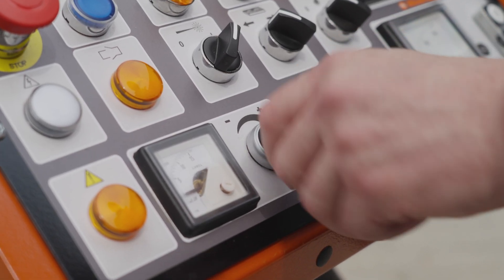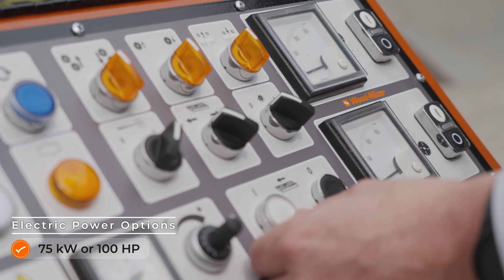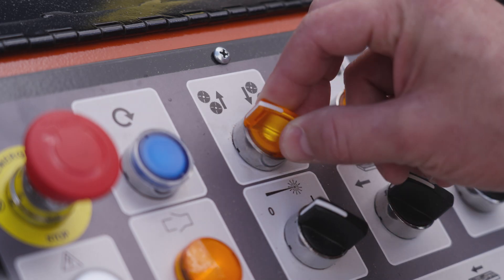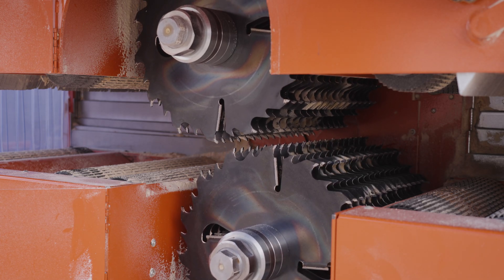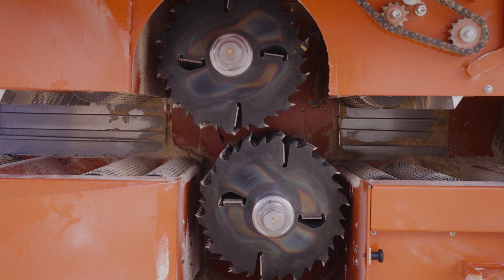There are a few key features that increase recovery throughout the cutting process. For speed, the MR250 offers electric power options up to 75 kilowatt or 100 horsepower. The feed speed is also automatically controlled for optimal performance, ensuring smoother and more efficient operations. Notice how the adjustable arbors boost the cutting speed and throughput when it aligns the cant before it enters the machine. Moveable arbors allow for smaller blades, giving you a thinner kerf and higher recovery.